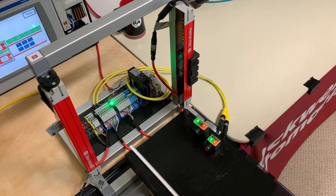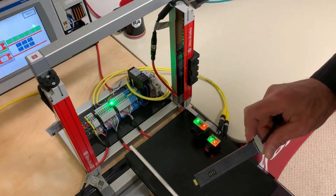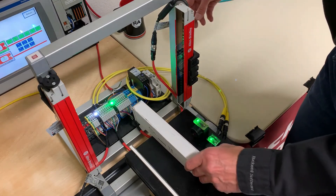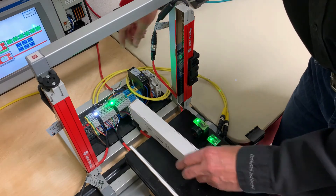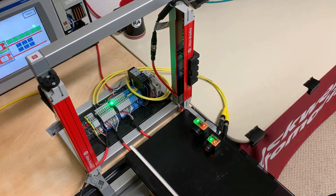Here's a quick example of two sensor L-type muting. As we discussed, there are DIP switches on the plug-in modules. We have the plug-in modules wired to terminal blocks. We bring our product down the conveyor — if you look really closely, there's a muting LED that's on. And as we bring it through, obviously the product can progress through the light curtain without shutting down the machine.